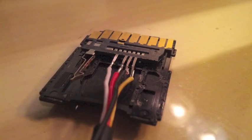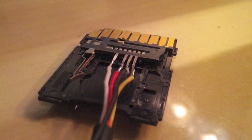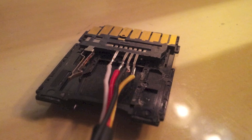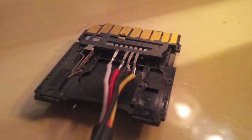Once you crack open your SD adapter, you'll see 8 legs. Skip the first two and solder your CMD to leg 3. Skip leg 4 because it's bridged and grounded with leg 6. Solder your CLK to leg 5, leg 6 is your ground, and leg 7 is going to be your DATA0 line.